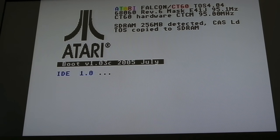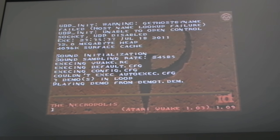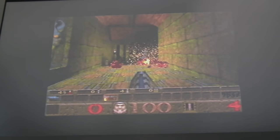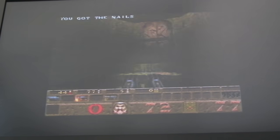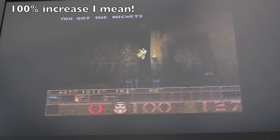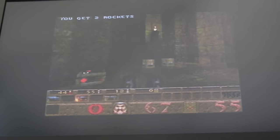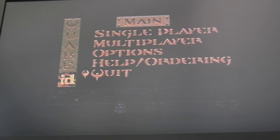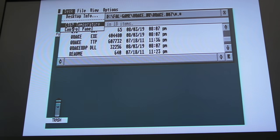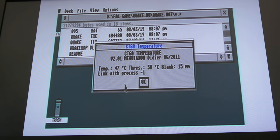Now at 95 MHz — I don't know how far I'd dare push this, but I might just try 100 then drop it back down. That's incredible — incredible that you can run these at 95. It's a 50 MHz part, but a lot of these Motorola chips you could get 100% and a touch beyond. The default is clocked at 66, so it's overclocked even at stock configuration. Let's not leave it too long — checking the immediate temperature: 47 degrees. About 10 degrees less than when running at 90 last night without a fan.